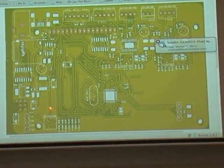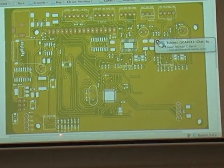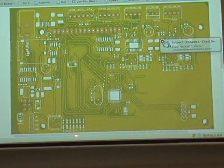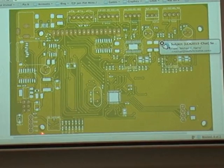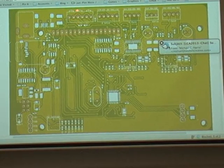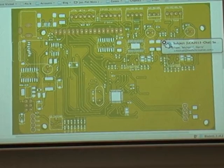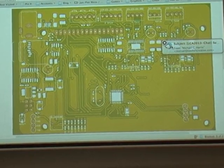Here there's a set of LEDs down the bottom, RX and TX, which show communications over the USB virtual UART for feedback and programming. There are 5 volts and 12 volts, so you can see the status of both power rails individually, and XYZ. They indicate when the three home switches are closed. You can test that by sticking a bit of wire across and shorting out those switch pads on the board, and you should see the LEDs light up if you don't have micro switches installed on your machine. That's all that will happen. The code won't stop because it's not coded in yet.